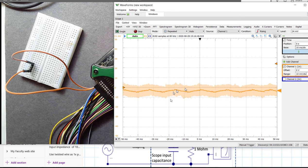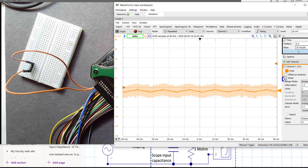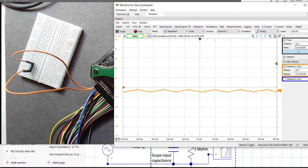Because we're focusing on 60 hertz, I'm going to turn off the high-frequency noise — we're going to look at that next. And here's the signature of that signal coming in. You can see there's definitely periodicity. Let's see if we can trigger on it at this level. And sure enough, we're triggering now on this signature.